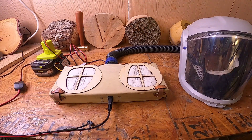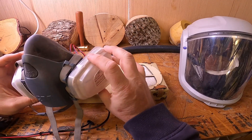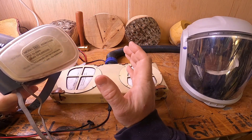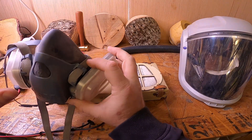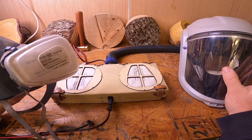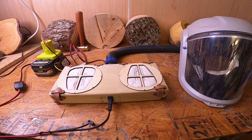The filters are 3M N95 filters. I would not recommend using this with any kind of chemical purification — if you need that kind of protection, I'd recommend using a properly selected half face mask with the correct filters, not N95s, or an actual PAPR. In this case, I want dust filtration for woodworking. The N95 mask doesn't sit quite well since I wear glasses, whereas the hood will cover your whole face, provide face protection, and a cooling effect with the airflow.